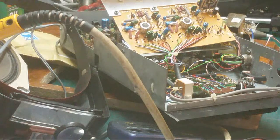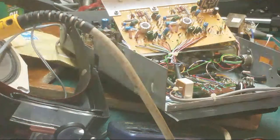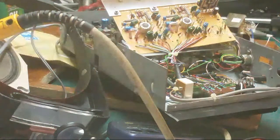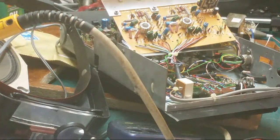All that's in here, Steve, transistor wise, is that regulator that's gone open. I mean, that's open wider than you can get. And there's a diode next to TR202 which is blown. Well, it's not blown, it's coming up okay, but you can stick your probe in the diode. So that's got to be replaced.